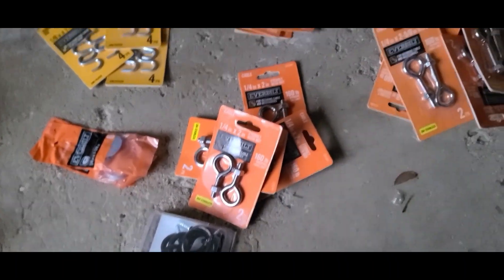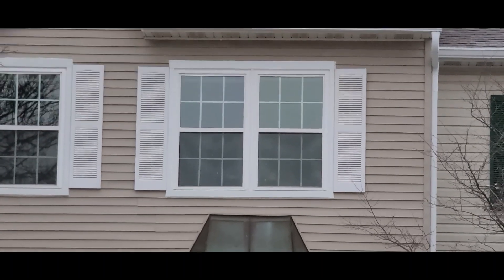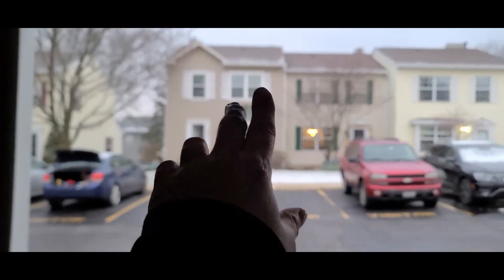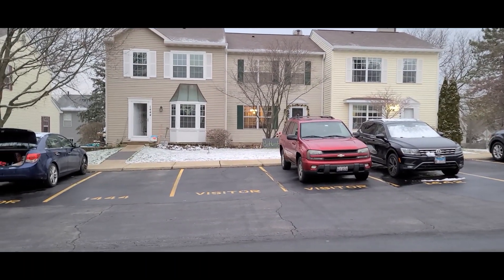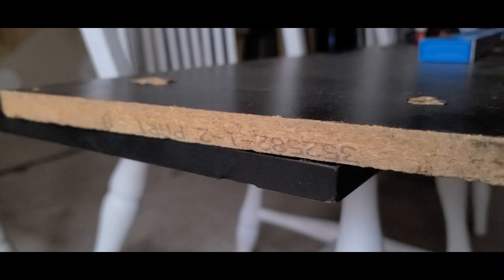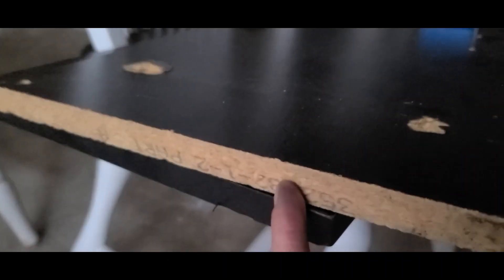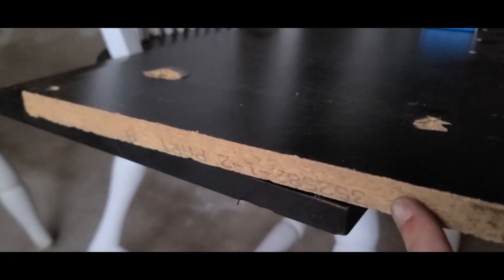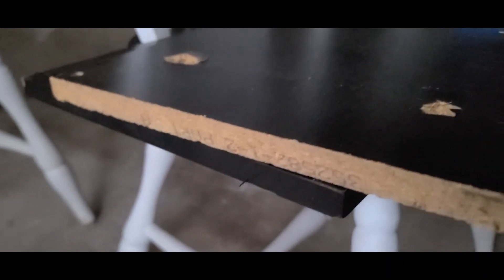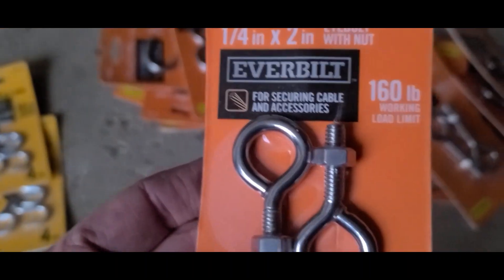These are the hanging supplies that I got, because the shelves that are going above these windows in my sister's room will be a shelf up at the top of the window. And then under the shelf she wants some macrames to hang down in front of her window — maybe five macrames in front of this window and two or three in the other so that she can hang some plants. Being that this is just particle board, it's not going to be very stable and sturdy. It's going to be very brittle for something like this, just to have one small little screw inside this wood — I'm fearful it would probably pull out.